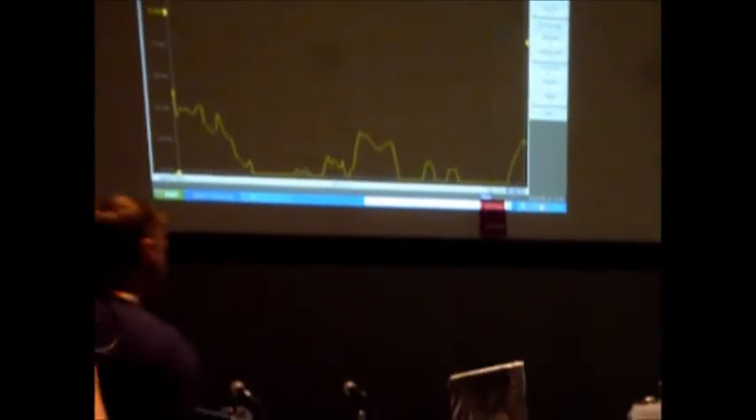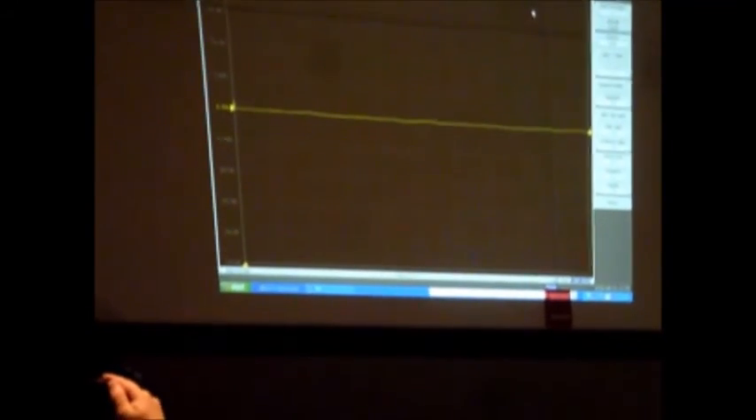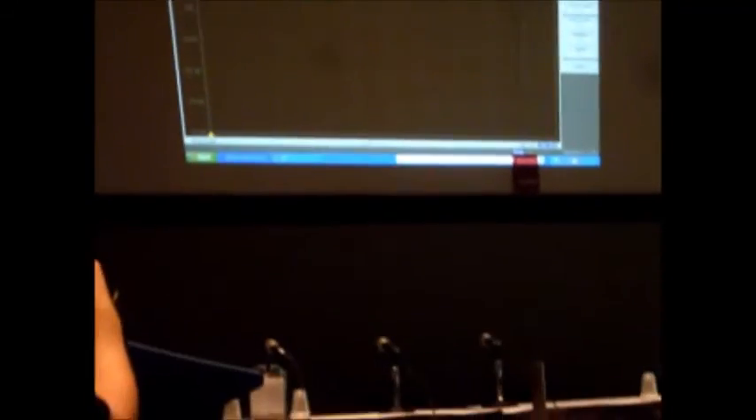Justin, take it back off there and prove that it goes back up. Good. The point is that what we've got here is an indication that knife-edge diffraction, at least in this example, is fairly minimal in terms of generating forward scatter. Let me remind you of the wavelength scale here since we're talking at S-band — this illustrates one wavelength at these frequencies. You can see the separation of the antennas is many wavelengths, and the physical size of the wall is electrically large.